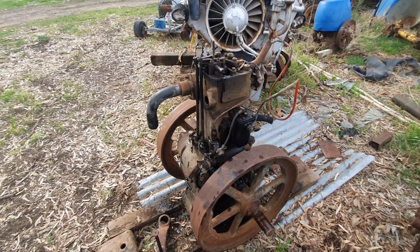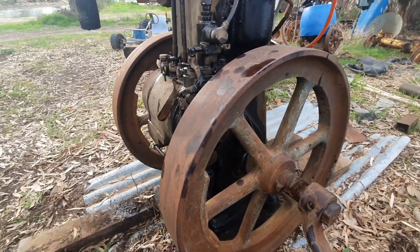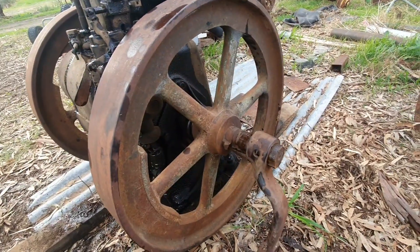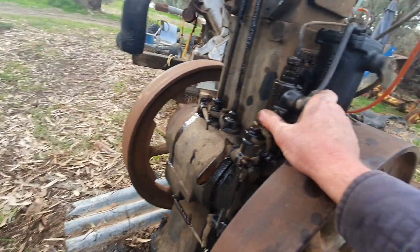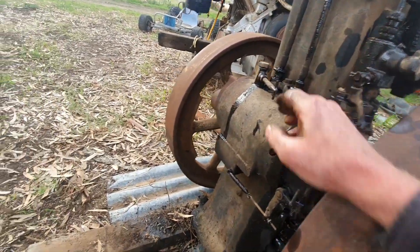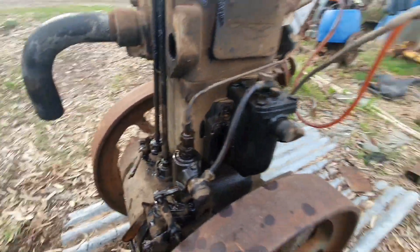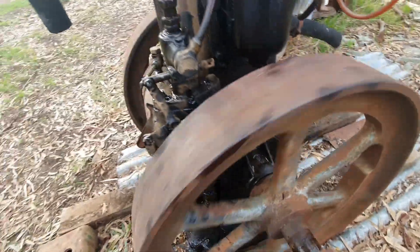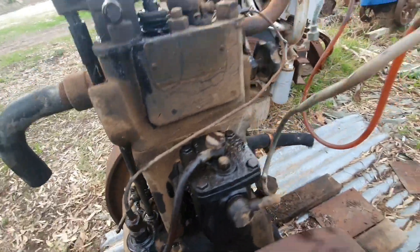How am I going to do this with one hand? Got the crank handle on there - strange one, it's got sort of a double-handed grip on it. Rack's working, got full fuel, won't worry about the decompressor - it's got a bit of compression there. Did wind it over a bit before, just bounce it a couple of times to get a bit of noise in the injector.